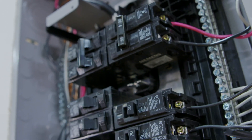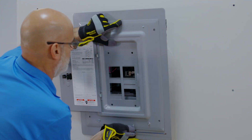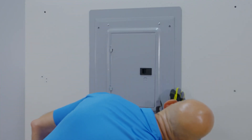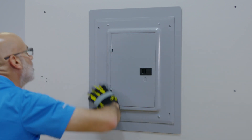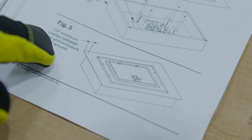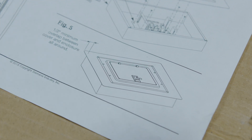After rewiring the new interior, we'll secure the cover assembly to the interior. Fasten the cover assembly to the interior assembly with the four cover mounting screws provided. Ensure that there is no gap between the enclosure and cover and that there is a minimum of a half-inch overlap between the top, sides, and bottom of the enclosure and cover assembly.